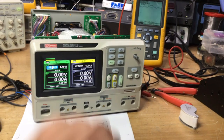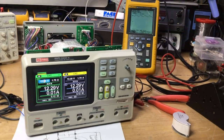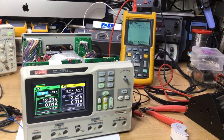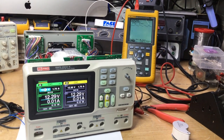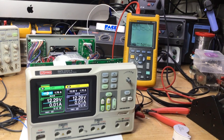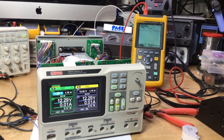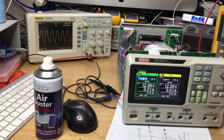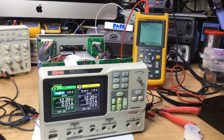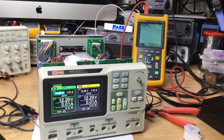And then once the output relays are switched in, now we're getting the 6.5 volts. See how long it lasts at that, but yeah, it doesn't last long. 6.4, it's dropped to already. Now 6.3, it's declining quite quickly. The AC waveform's remaining constant on the input, so it's not as if a transformer's got an issue. Down to 6 volts nearly now, it'll not be long, it'll power off.